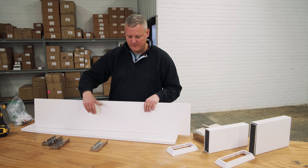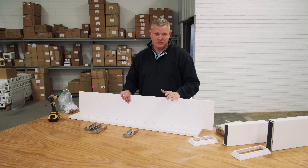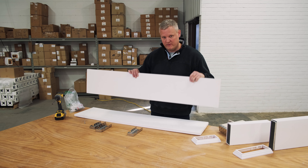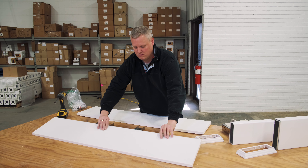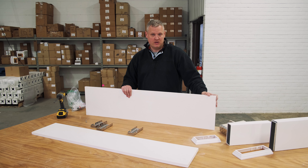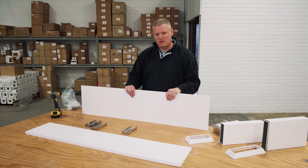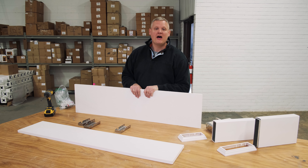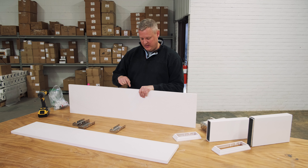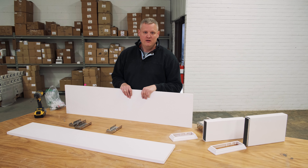Attaching to a house, there is a little bit of nuance involved in that you want to make sure you get into something structural on your house. We include a trim board with each one of our kits. If you have a two-by-six rafter there's a one-by-ten piece of AZEC trim. If your kit has a two-by-eight rafter there's a one-by-twelve piece of AZEC trim. This board is not structural — it looks nice but it will not hold your pergola in a heavy snow load or a heavy storm. We want to make sure we fasten to something structural inside the house. If you do not know what's structural inside your house you need to consult a professional, and you may need to put up a ledger plate in addition to this piece, like a structural two-by-ten or two-by-twelve, to make sure that the pergola is going to bear proper snow and wind loads.